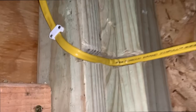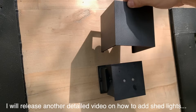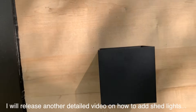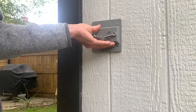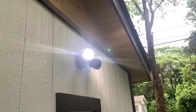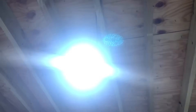The routing goes above the roll-up door and down to the actual power feed. I installed decorative lights on the front of the shed the exact same way as the side lights, then routed the electrical cable from those lights to the incoming power supply with the exterior switches. I wired two light switches on the shed's exterior: one controls the two exterior lights on the sides of the shed, and the other controls the decorative lights on the front. I also installed an overhead bay light on the inside of the shed.